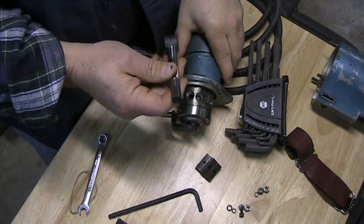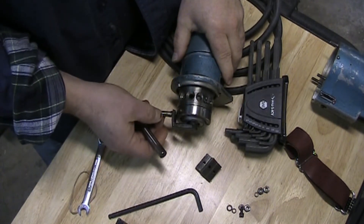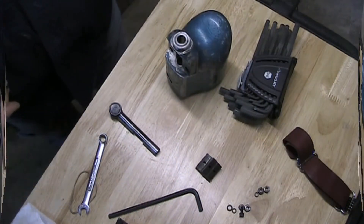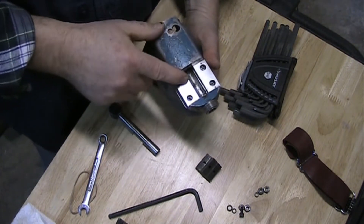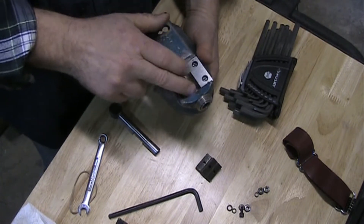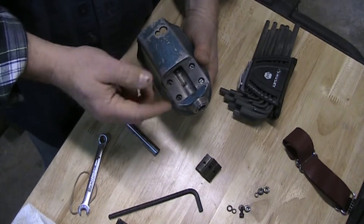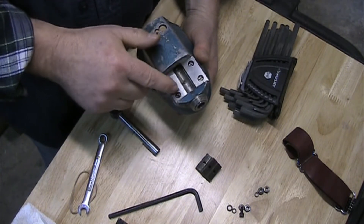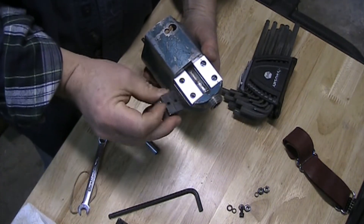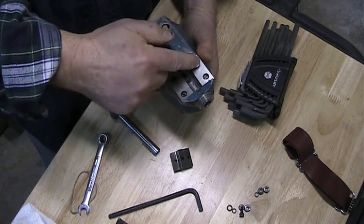We're going to put some grease on this rod, put it into the scraper head, and then reassemble the whole thing. Here's the scraper head — I've gone ahead and put the ways on. The reason I did that is because I had to shim them. I only took about 10 thousandths total between the top sides of the ways and the underside of the shoe to clean the whole thing up, which was probably a little more than what the slop in the holes gave me.